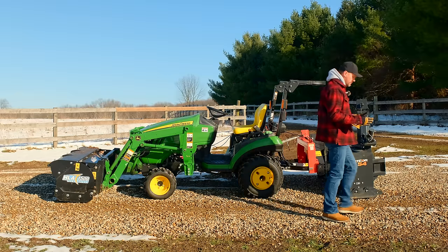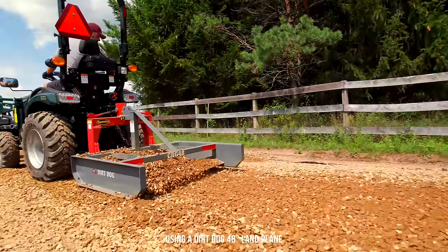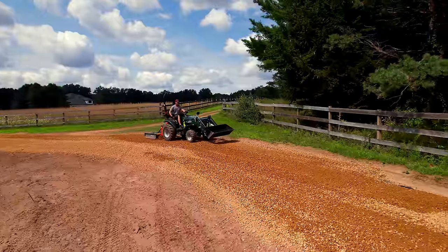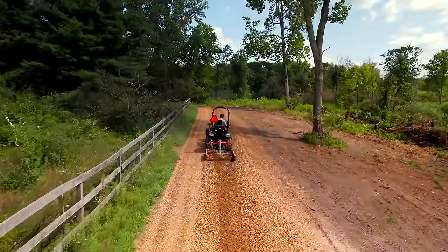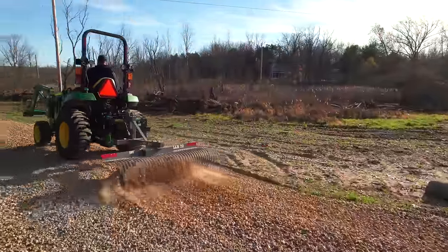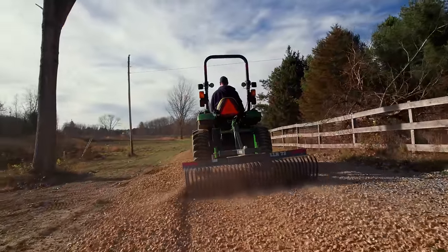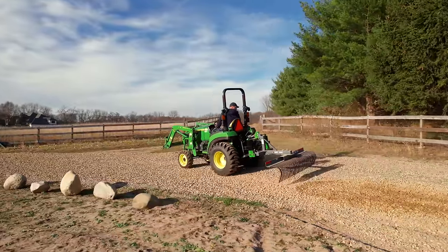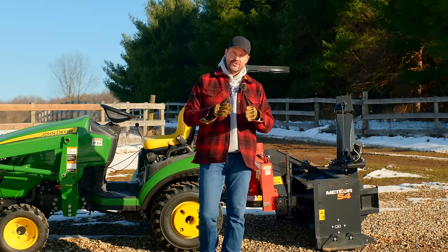One of the big things you need to do, no matter if it's snow season or not, is maintain your gravel driveway. If you have a very uneven, rutted-up surface right out of the gate when you start plowing, you're just asking for trouble. If you have potholes, washouts, or other drainage issues you see coming, fix those in the fall — they say an ounce of prevention is worth a pound of cure. Just take your land plane, rake, or box blade and grade and smooth out that driveway. It's a pain to get gravel out of your lawn, and it's expensive to have more dropped off to fill those problems. A little bit of regular maintenance is easy if you stay on top of it — don't let your driveway get out of shape, and you won't have those major projects to deal with next spring.